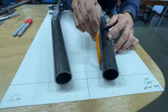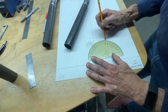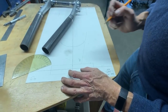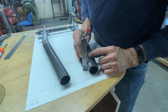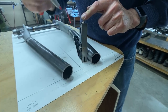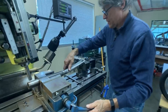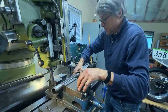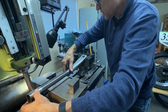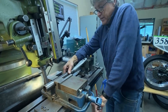I'm going to make a line right down here. It looks like 11 degrees. In class, if I'm doing a class, I do M11 — M stands for miter. This is the easiest way to mark it: put a combination set right up to the corner like that, press down, make your mark. I can take out this one and put the next one in against the stop — I can't have a space there, I need to go back against the stop. Put in the extra v-block and make it tight. That's going to work for both sides.